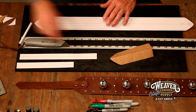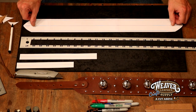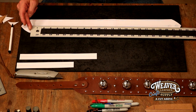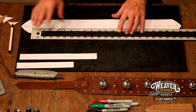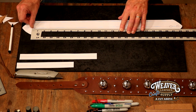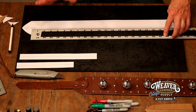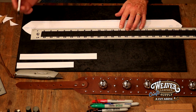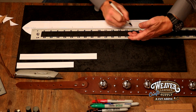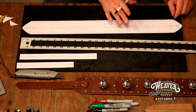We're going to put six bells on the strap, but there's a bit of a trick to this. I need to take this distance, divide by seven and not six, thus giving me my end point. This should be 20 and a half inches — that's exactly right. That's going to be confusing to divide by seven, but we've got an easy out. I'm going to move my pattern so my straight edge starts one quarter outside of this rivet hole and ends one quarter outside of this hole, thus giving me 21 inches, much easier to divide by seven. That's going to give us three inches.